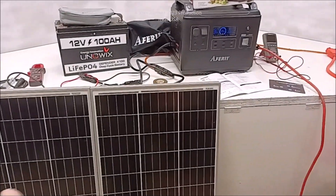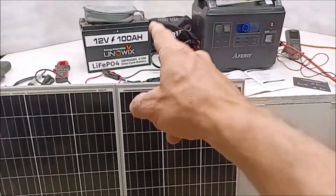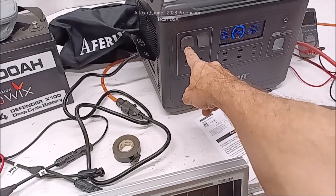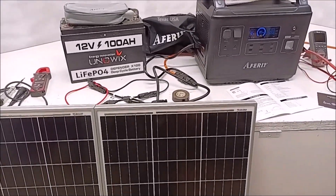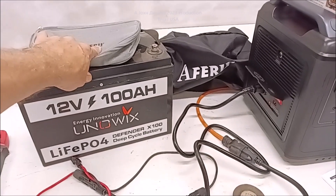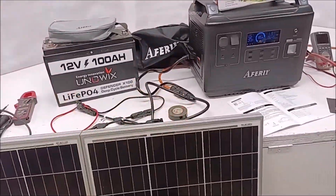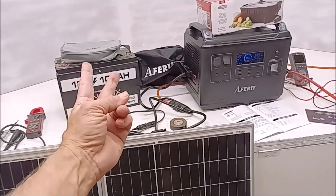So why would you do this? Because this is the easiest way for most people — about $1,100 and another $500 worth of miscellaneous parts. If you got that battery and charged it off that outlet — which you can do, since it puts out basically 14 volts and it's BMS-disconnected — you could back-feed that battery at night into here instead of paying a thousand dollars for a battery thing that does the same thing.